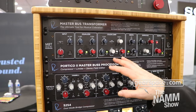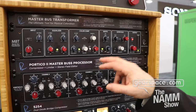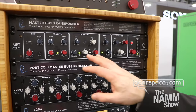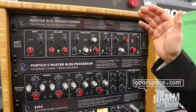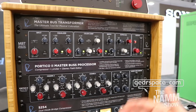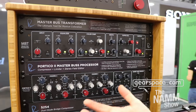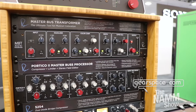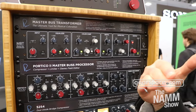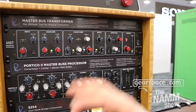One of the things that's been very exciting is this is a brand-new compressor from us — it's actually a stereo optical compressor, but it does have fully variable release and two different ratios. In the low ratio it's approximately 2:1; in the high ratio it's approximately 5:1. Very adjustable threshold and lots of makeup gain. We also have parallel compression or blend built in. That second high-pass filter is strictly in the sidechain of the audio path, so that with very bass-heavy material, instead of having low frequencies triggering the compressor or dominating the compression profile, you can sweep up the high-pass filter to eliminate low frequencies from the control path. It's not taking away any low end — it's just telling the compressor to look more at mid-range frequencies.